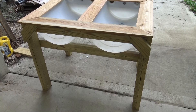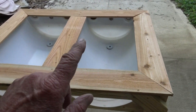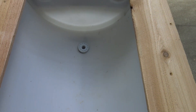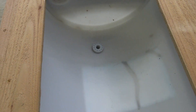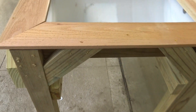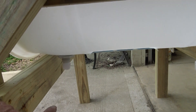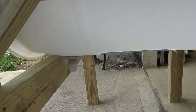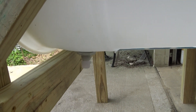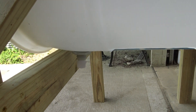I think it's done. I have the drains - these are called tank drains, I got them at Lowe's. Basically you drill a 1 and 1/4 inch hole, stick it in, and it has a rubber grommet that seals it. Underneath you attach this small piece, and then you can attach a garden hose to it. I have some pieces of garden hose that'll hook to it so when it drains, it'll drain off of the deck and not onto the deck.